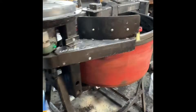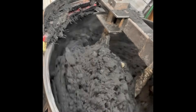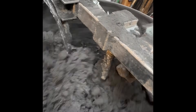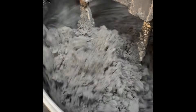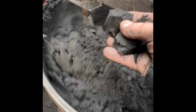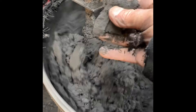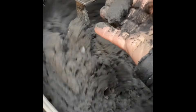In a moment we'll add some water and you'll start to see the character of the sand changing. Right now you can see the sand is forming just a little bit of clumps, but as I add water here it won't take very long and you'll see much bigger clumping starting to occur. Right over here you can see sheets of sand forming, and that's a sign I look for to know that my sand is getting about enough moisture and has pretty good green strength. It breaks nice and cleanly and yet holds together pretty well — that's what we're looking for.